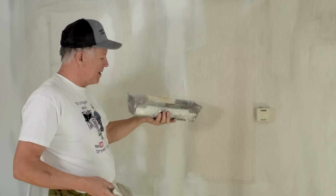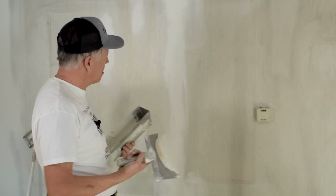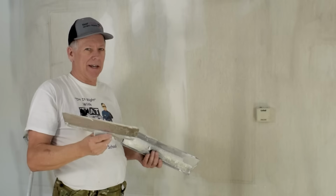Now, I've showed you in other videos how to properly hold your knife and coat these, but I'm going to show you here because 95% of my viewers are not subscribers. So what you want to do is load your mud up about like so, a pretty decent amount on there. You could put more, but you might drip. You don't want to be dripping, so the mud is not thinned down. Coming out of the bucket, it's a little bit thin, so I left it just the way it was. The lightweight mud, I'll often thin it down.